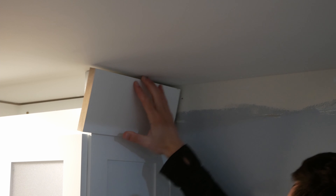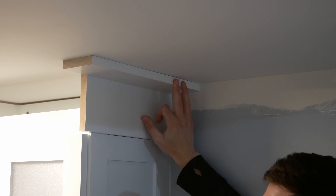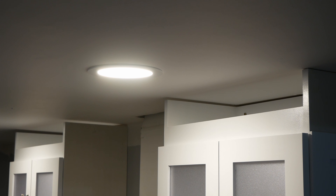For crown molding, I'm going with a really simple design with a one by six up against the cabinets and walls and a one by four that butts up against that and sits up on the ceiling, but you can definitely go with whatever crown molding you like best. I'm not actually going to install the crown molding right now as it's going to be a lot easier to figure out the measurements relative to the range hood cabinet once that is made and installed. Alright, we are done making the cabinets and the kitchen is getting pretty close to done. All the tools and materials I used are linked down in the video description along with the free plans. If you liked the video, give it a thumbs up, leave a comment, and if you're not already a subscriber consider doing that. Thanks for watching and until next time, go build yourself some cabinets.